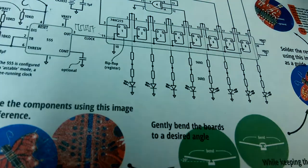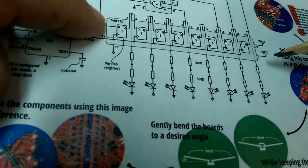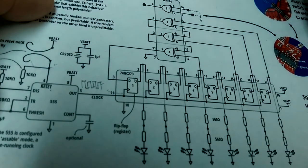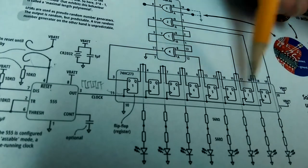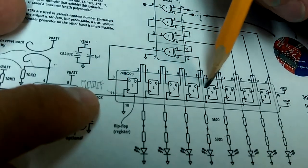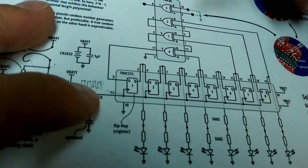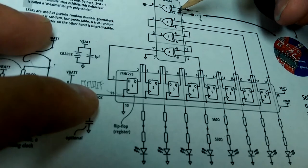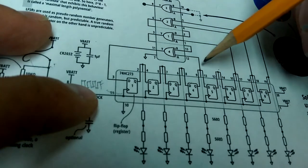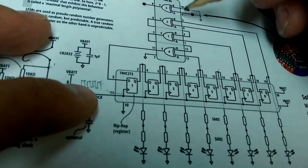And so one of the things that they've done is this bit stream is pseudo-randomized through the use of something that is called a linear feedback shift register. So these eight D latches are being used as a shift register, like I said, each clock cycle moves whatever bit you've got down. But a linear feedback shift register uses XOR gates to feed back information about these bits.